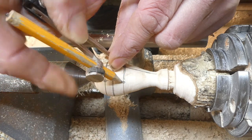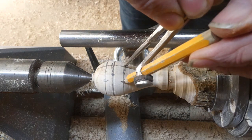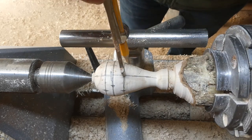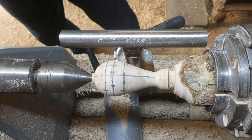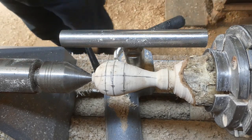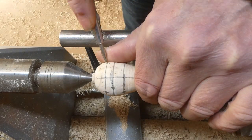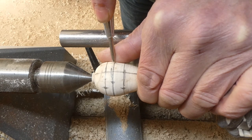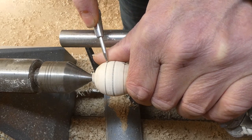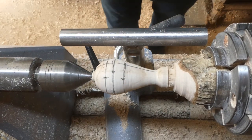I'm making the marks now because I want to drill before I actually finish off the head. What I tend to find is that when drilling, it tends to lift the surface up a little bit and leaves the edges a bit ragged. So if I do the drilling first and then do the finished cut and sanding afterwards, I should end up with nice clean holes. This is a centre punch which helps to position the drill — makes it much easier.